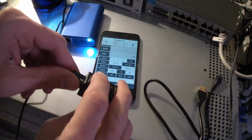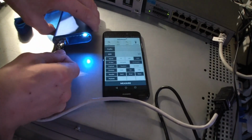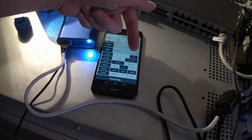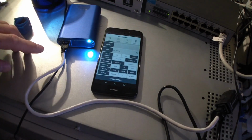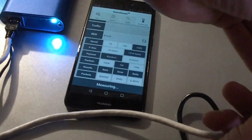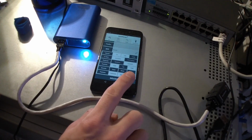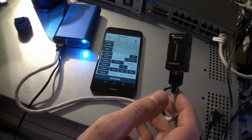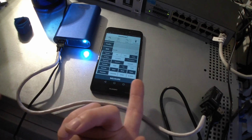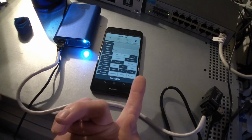Let's test this cable here. It shouldn't be defective. It should be 0.5 meters. So let's measure that with full gigabit speed. No errors. And if you have errors, let's force that maybe. See, there you can see when you have errors, when you send packets through the cable and the cable link breaks or something, you get an error margin. This is not really a lot in 10 million packets or 1 million packets, but you can see how bad the cable could be.